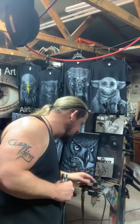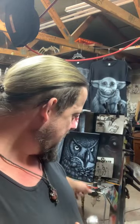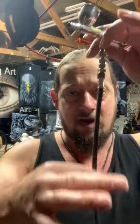I use this secondary regulator the most. On the air compressor I usually keep it at around 50 unless I'm going to air up a tire or something. This one is set on 30 right now - so I've got 50 coming to me and I kick it back down to 30. I've got two moisture collectors on it that help collect moisture so I'm not spitting water through my airline. That's my air compressor setup.